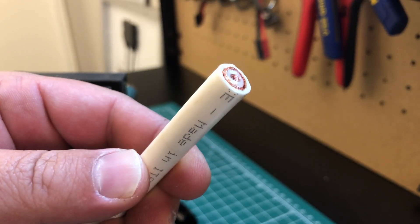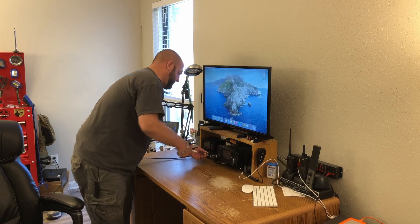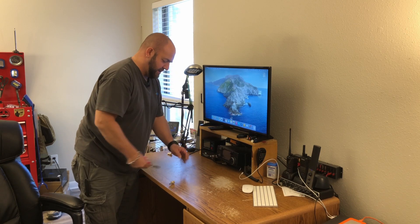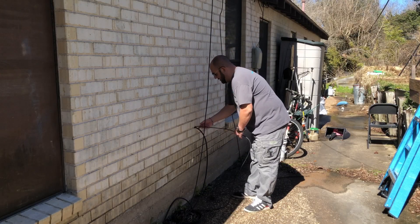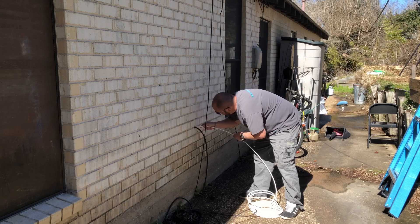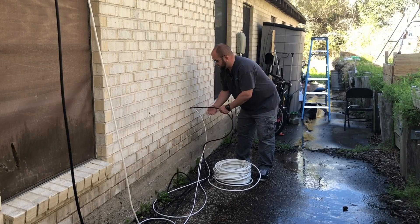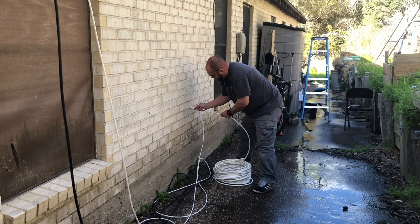Ready to get fed through the wall. Now I've got to rip out the old coax. We can just cut these. Now I can take the old coax out of the wall. The RG-8X is gone. Hopefully we can feed the new cable through easily — I think we're in. Now we can finally get rid of this pesky RG-213 and go ahead and install our HyperFlex 10 Sahara.